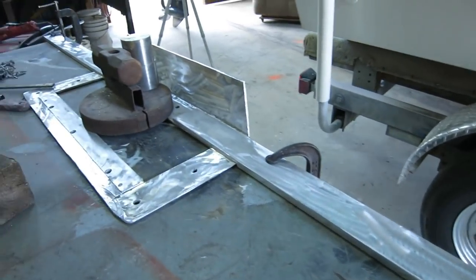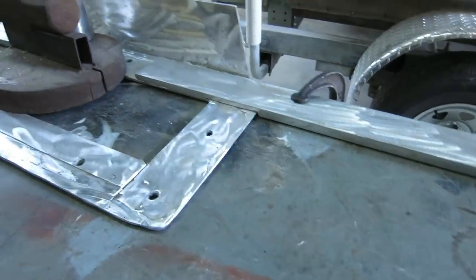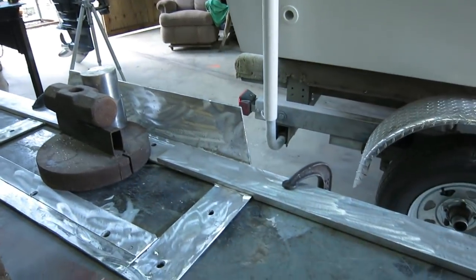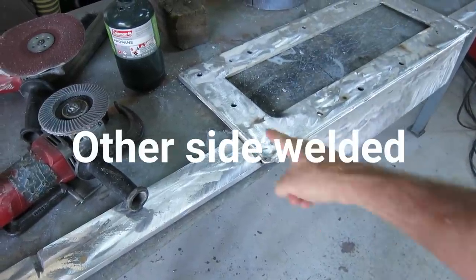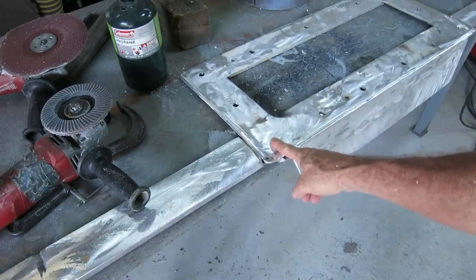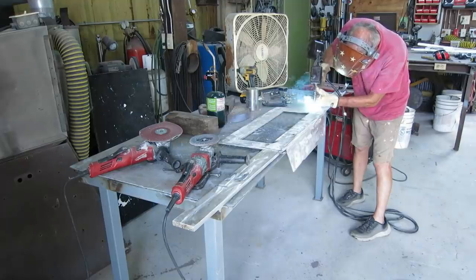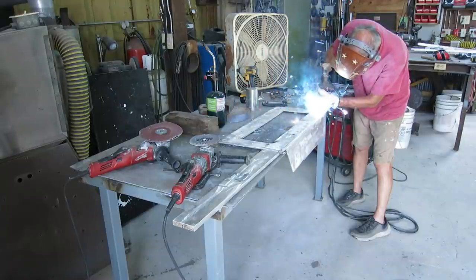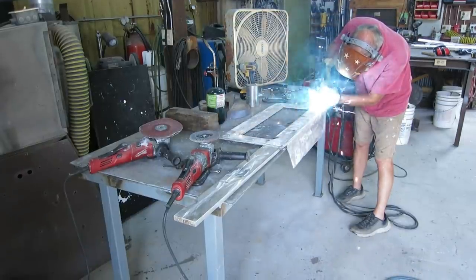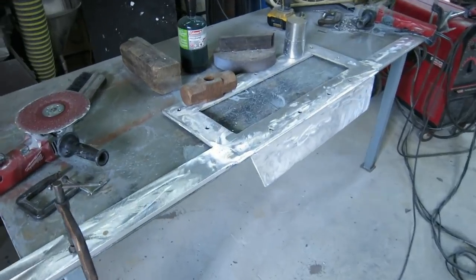Got everything clamped down tight, it's straight, the joints are clean, the flange fits flat to the table — which means it's going to fit flat to the transom. With the flange part flipped over I can weld out here and fill this abandoned hole with weld. These two holes will have to be filled after flipping it the other way. I'm considering this a non-critical weld because it'll be in compression and the metal is really thick, so I'm comfortable doing these welds myself.